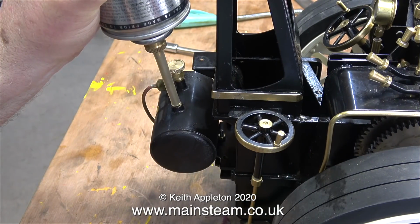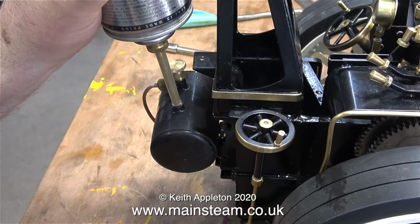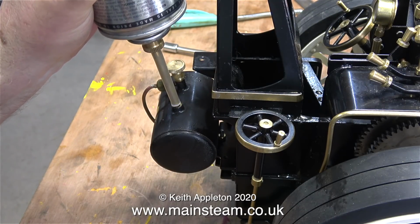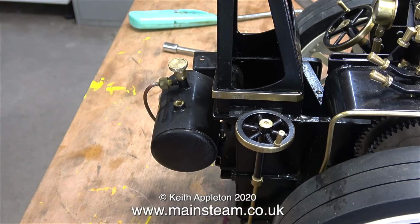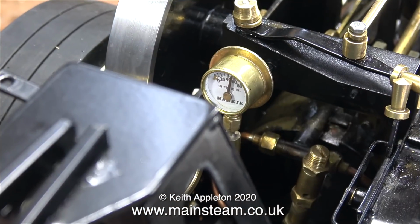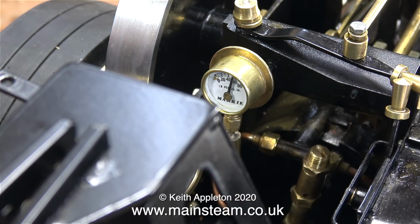The gas pressure has dropped. I've turned off the gas tap on top of the tank and I'm refilling it. Because the gas tank is very cold and the commercial gas cylinder that I'm holding is now quite warm, the liquid gas flows into the gas tank very well. In no time at all, once I lit the gas burner, the pressure soon increases inside the boiler.